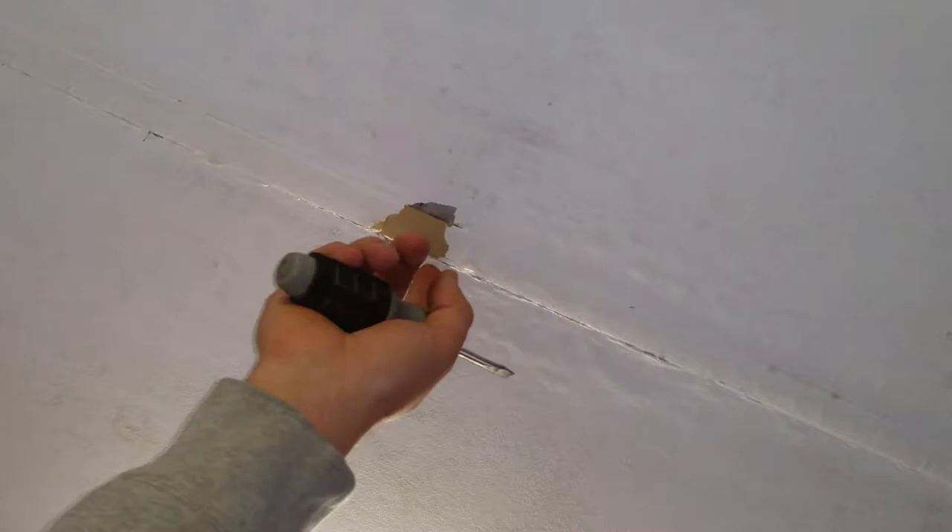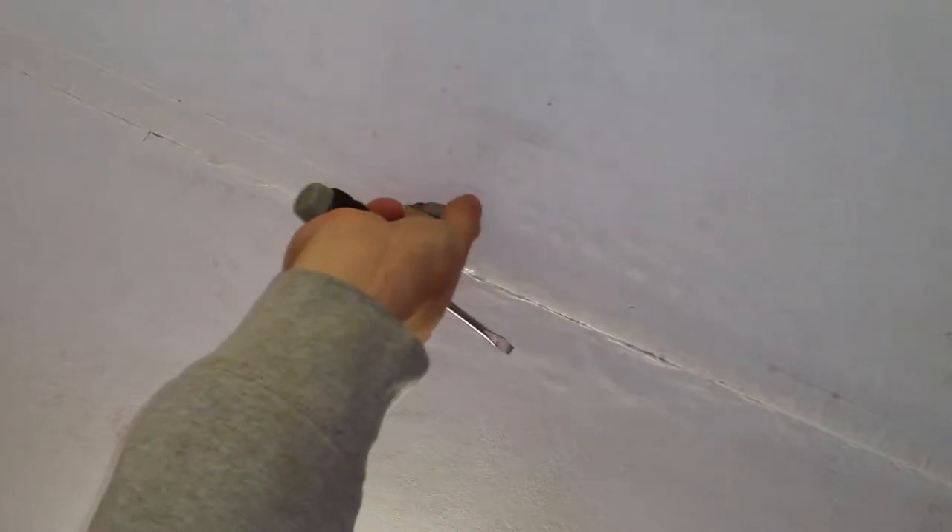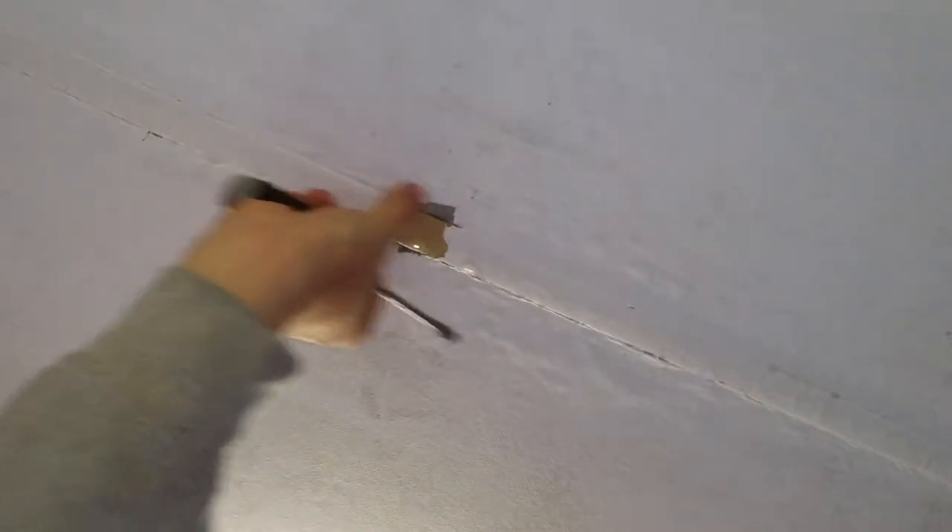This really sucks a lot. So there's a board that runs between the ceiling and the roof right here, and there's insulation in there, and that insulation's wet. So what we're going to do is take another piece of dryer hose, attach it to this one, run it into the ceiling where the speaker hole is, and use the RV's furnace to dry out the ceiling area. Do you think it'll work?